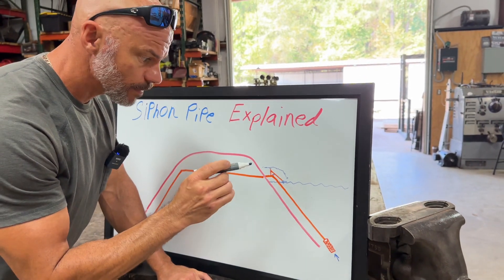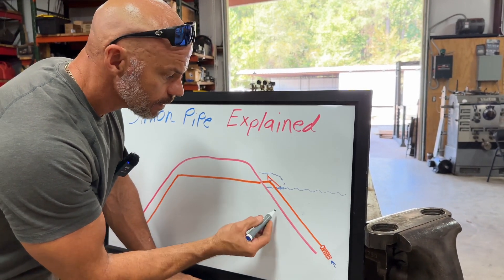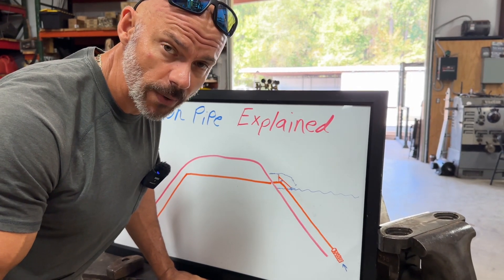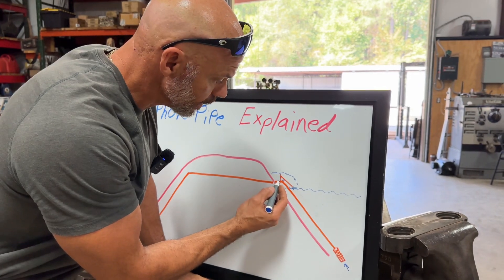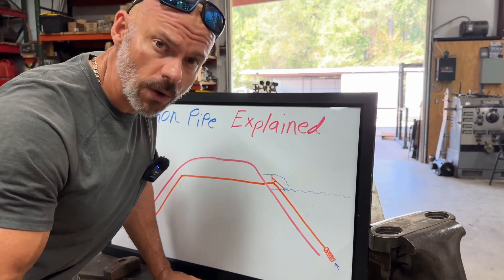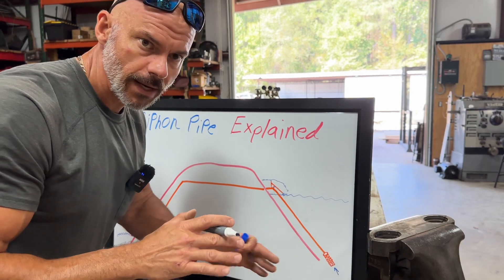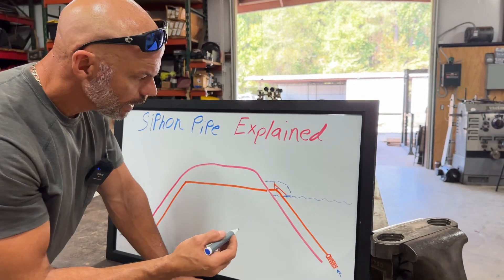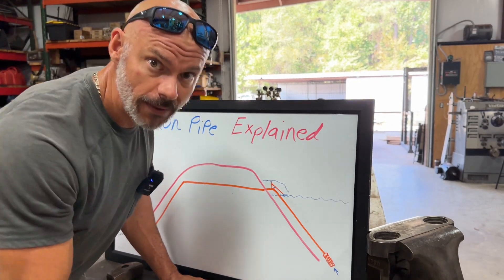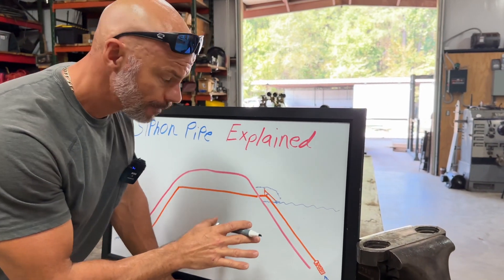Now, here's the problem. I've noticed I get so much runoff when the water gets up here, my dock is about an inch from going all the way underwater. It'll start a siphon as soon as it gets here, but it's not pulling enough to get it all, and as it's up here, it starts going over the emergency spillway, which that's not what you want all the time. That's why you would want to use a siphon pipe — to let it out slowly and not have to deal with a bunch of erosion and all that. But like I said, it fills it up too much, and then it pulls it down too much, in my opinion, so your dock's almost underwater, and then it's way out of the water. So I'm actually going to put a 20-inch culvert in, and I'll still have this option if I want to, but that's how it works.